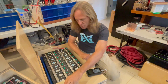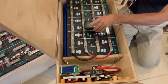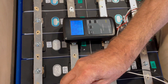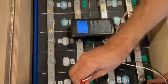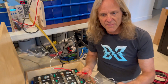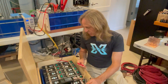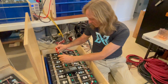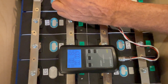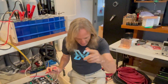This is a batch of batteries I'm top-balancing right now, and at the end of each row I have these jumpers — these are four gauge jumpers, longer ones. When I measure these four gauge jumpers I get about 0.25 milliohms. That's substantially more than the copper bus bars at 0.05 to 0.06 milliohms. These brass bus bars are measuring around 0.16 milliohms — about three and a half times as much as the copper bus bar.